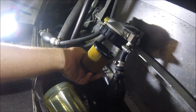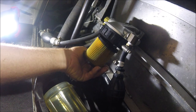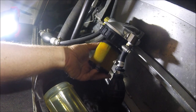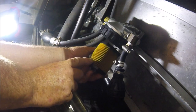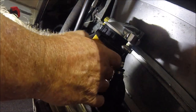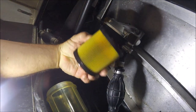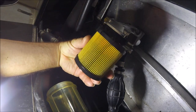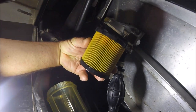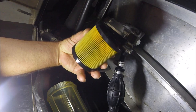Compared to a Raycor — and I'm not poo-pooing Raycor or Parker filtration or Wix or any of the other ones used on a boat — I can buy this filter element, which is about 10 micron, and if you look at it it is a very, very tight filter. I have cut open Raycors and they look just like this thing. There's not a lot of difference that I can see.